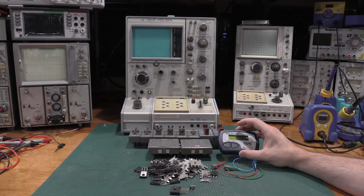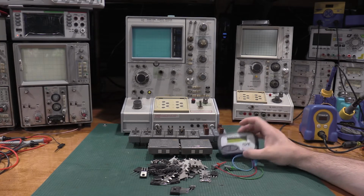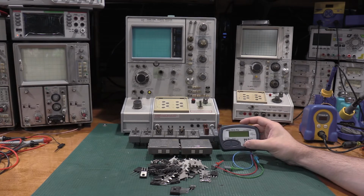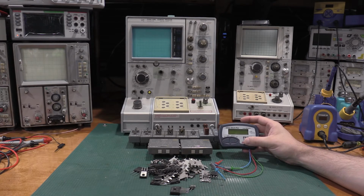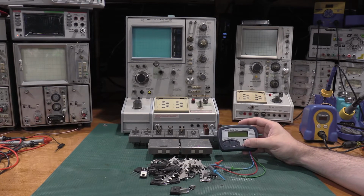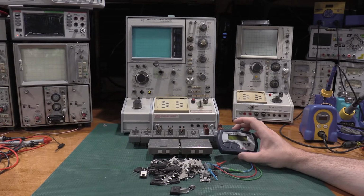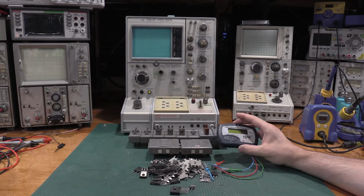But to load test it to see if it's leaking, it just can't generate the voltages and currents. So, primarily small signal stuff. Very useful though, because you don't need to worry about how to hook it up. You just clip the 3 leads on there and the thing figures it out itself. Very nice unit. So far the computer interface capabilities are worth the Pro features for me.